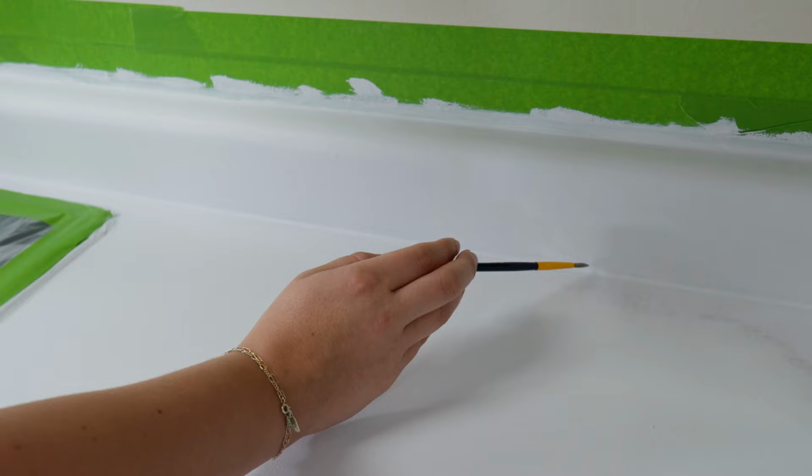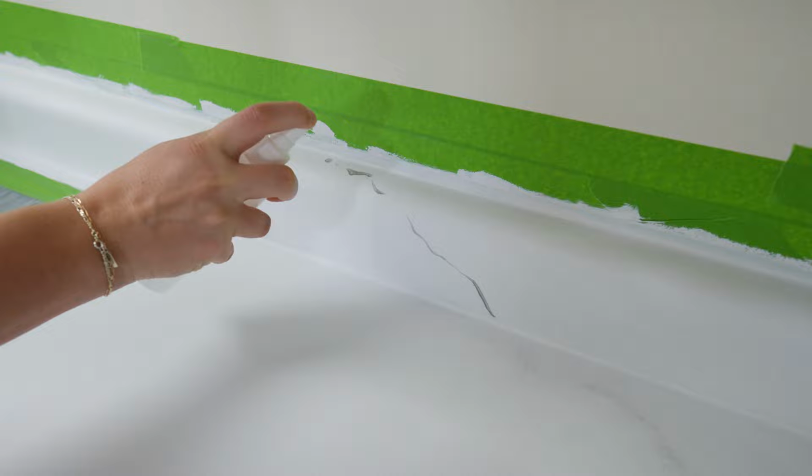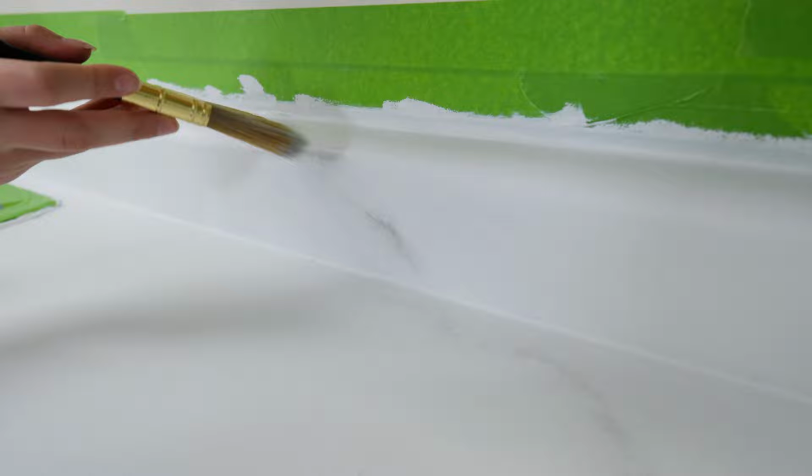For backsplash veins, use the veins you already created on the surface of your countertops and connect. Follow the direction of the veins for a more natural appearance. Be cautious not to overspray the veins with water and watch for runs and drips. For the edges, connect your veins to the ones you created on your countertops and follow the direction of the flow, just like on a slab of real marble.